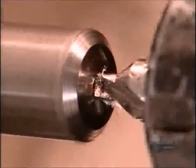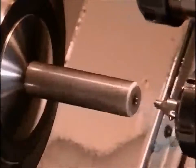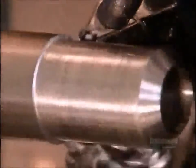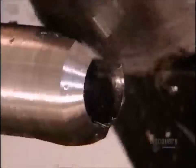The same machine makes plug cutters. Its center drill makes a starting hole, but this time the main drill doesn't bore right through. It stops at the depth that the plug cutter is designed to cut. Just as before, the rough turning tool shapes the body, and the milling cutter sculpts the four blades.